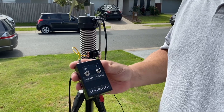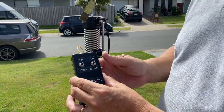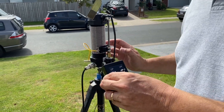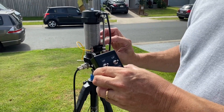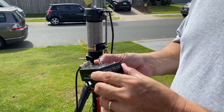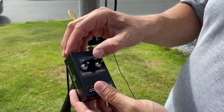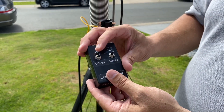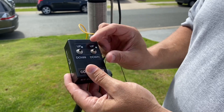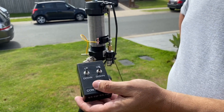Here's the controller — as I said, this can be anywhere in line with the power source, so it can be 30 metres away. If I'm inside the shack and the antenna is out front on the tripod, I won't have any visual indication of where the contact is against the coil. So I've worked out some timing: going from 40 to 30 metres takes about 24 seconds. I've got two toggle switches — one is permanent up/down, and one is momentary up/down for short, fine tuning adjustments.